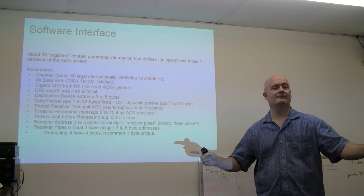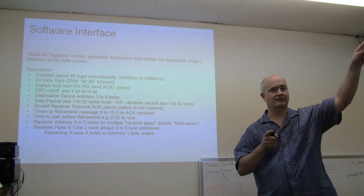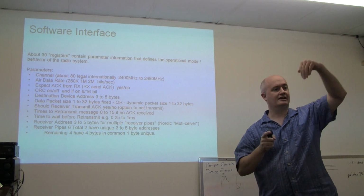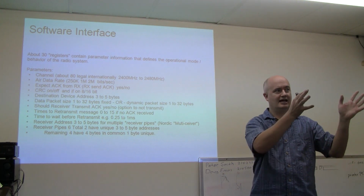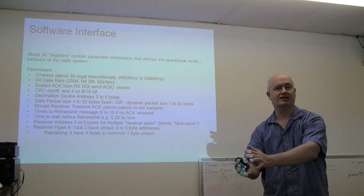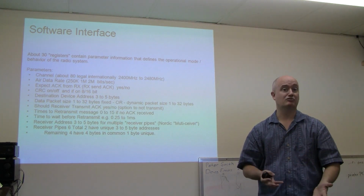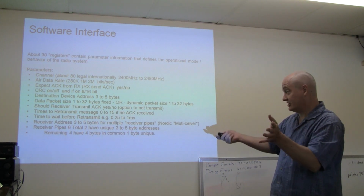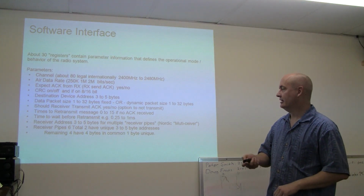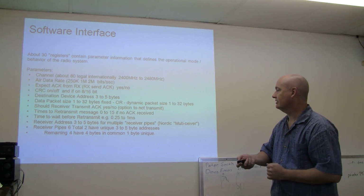But it's designed where the radio can be receiving from multiple sources, kind of like a star type of topology where you'd have multiple transmitters sending data, and yet we could have them with sort of a cluster of addresses where another radio system operating nearby wouldn't be challenged by that, even if it was on the same channel. Which channel is a great way. The 80 channels immediately gets you separated from your neighbor, but the other thing is those addresses discern who's talking.